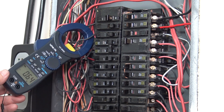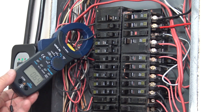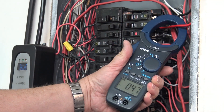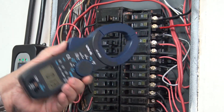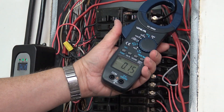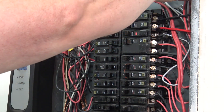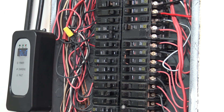My test bench is drawing 0.6 amps — just a monitor and isolation transformer with nothing else running. Clamping onto the big main wires: one reads 1 amp, probably from lights and other things plugged in, and the other reads 0.3 amps likely from a security camera monitor. The large breakers for the heat pump are drawing almost nothing since it's not running right now.